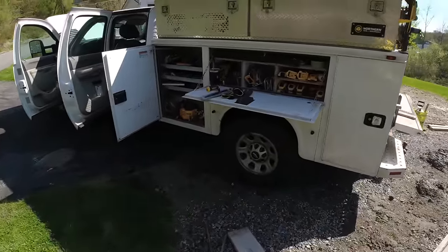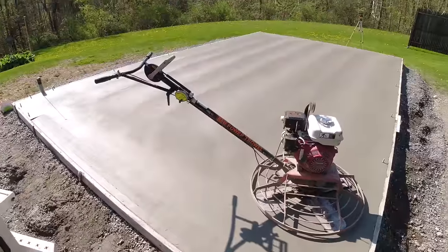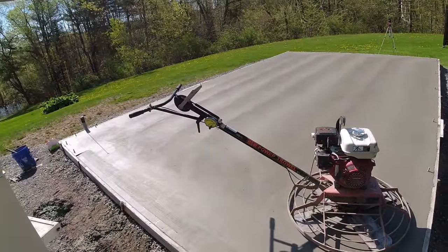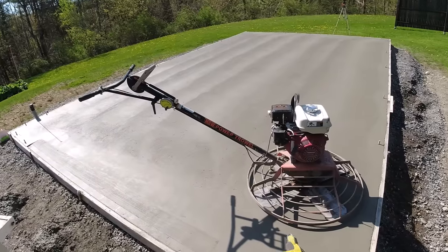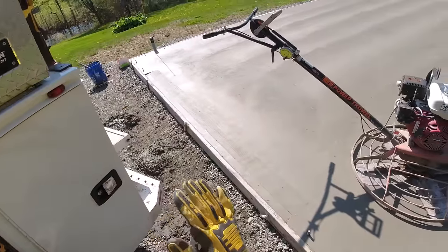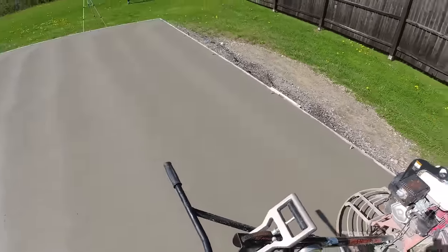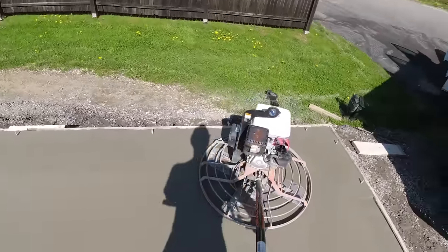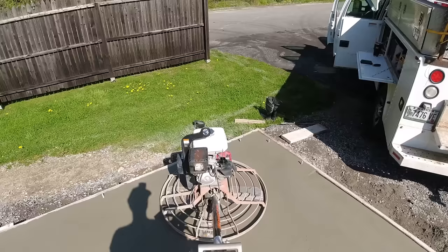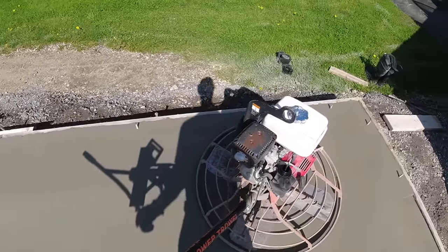Let's hit it again. Again, I wanna make sure I break my blades before I just go pull the recoil over. Just tug them and break them so they don't stick and pick up a big chunk under there. Bring my trowel out with me just in case I do pick up a chunk, I can fill it in while I'm out there. Just a tiny tug like that, get them broke real quick and get it started.